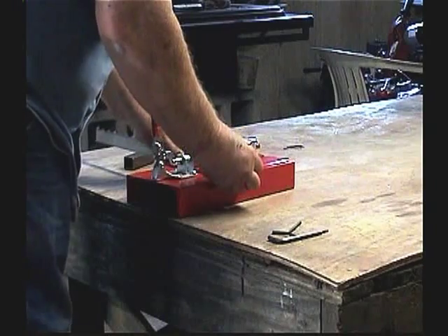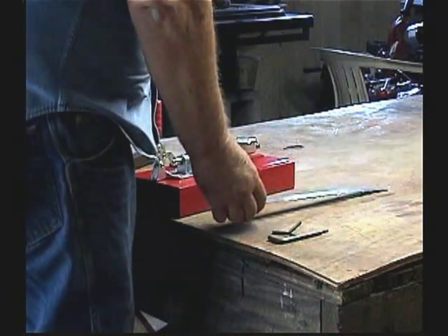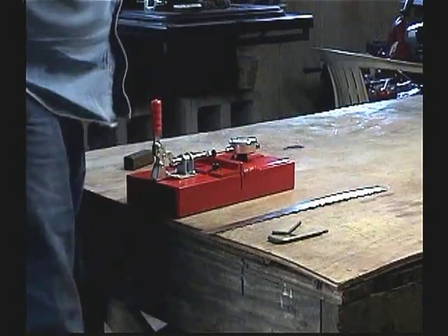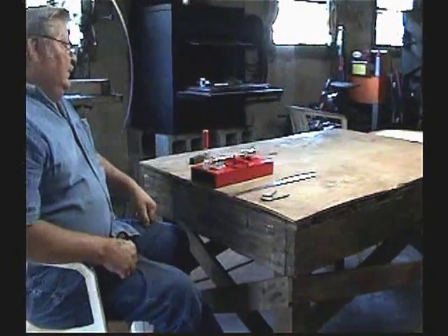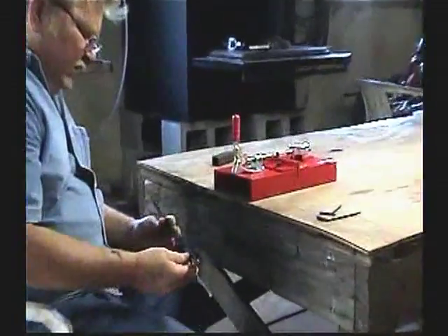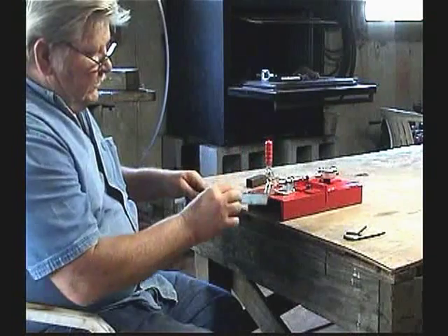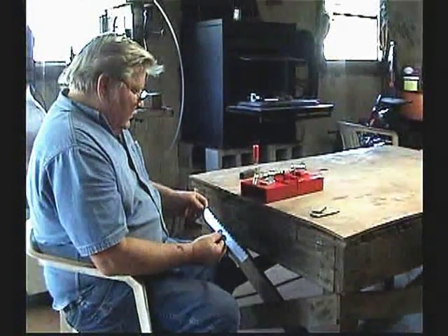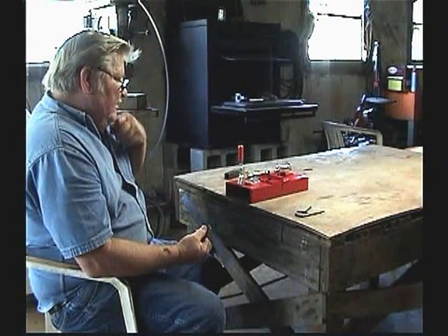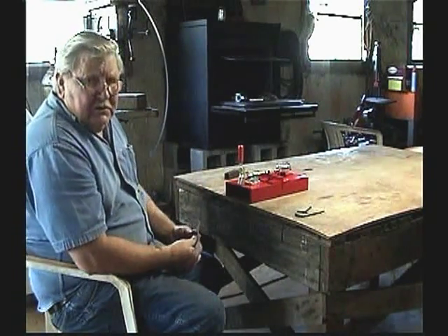What we've got here is where I cut this blade off with that barrel on the end. But anyway, that's the way you set your blades. You always want to set your blades before you sharpen them. After you go all the way around your blade setting one side — the side facing that way — you just flip your blade, put it back in, and you're setting the other side. You can set a blade in five or ten minutes once you get the hang of it.